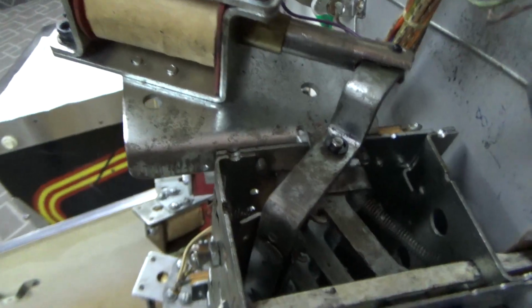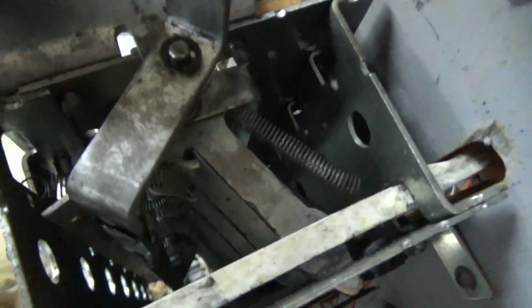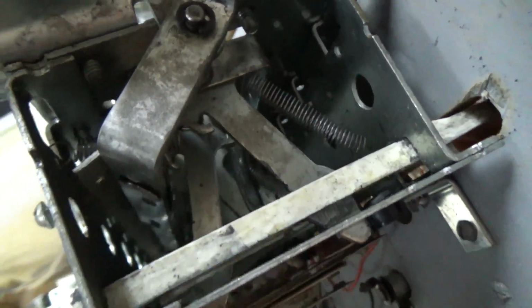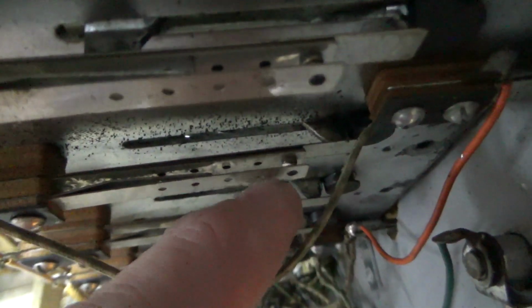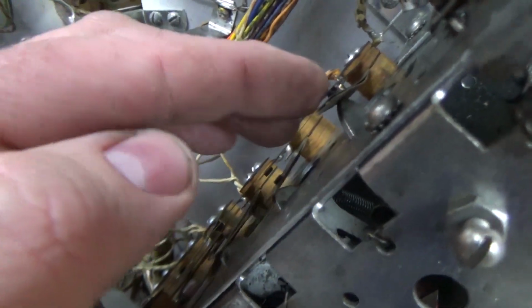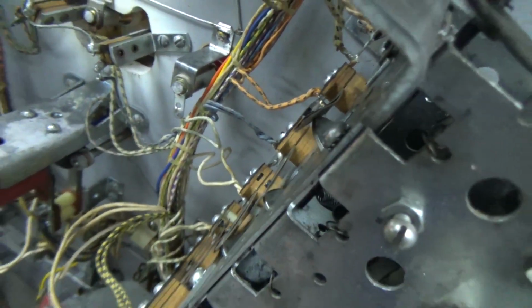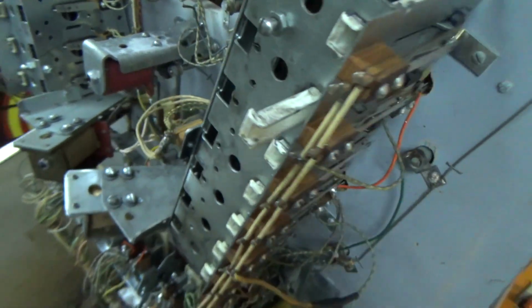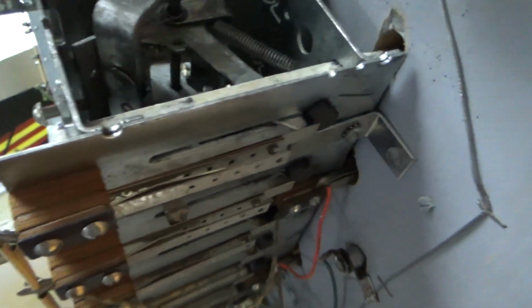the second one, so we can keep looking at this first one. So when it just goes barely over the ledge, bam, it immediately goes down. Okay. Now if you look, there's the second switch. Look, it's not touching. That's because there's another switch on the other side that is touching. So that's how it knows that it's down. And so whenever this turns around, it's going to be looking for how many of those are down and give you 1,000 points every time it runs into one, right? Or 500 points or whatever it is.